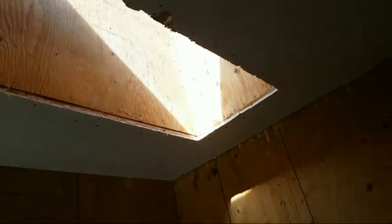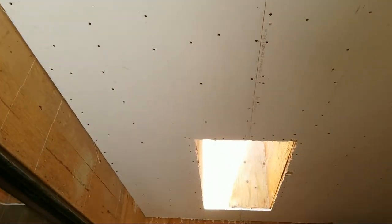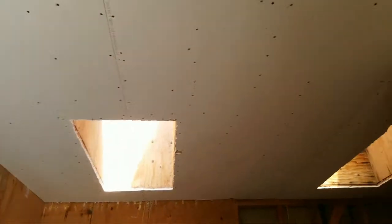And so, again, this is one sheet of 12-foot drywall that this drywall lift made happen. And this was a second sheet, 4x12s went in here. 8 inches apart on the screws in the field. I call it the middle, but the construction term is called the field. The center of your drywall is the field. Your perimeter, the edges is your perimeter, and the center is your field.